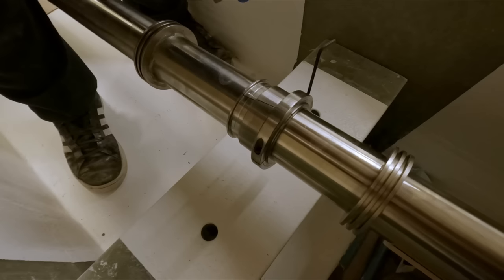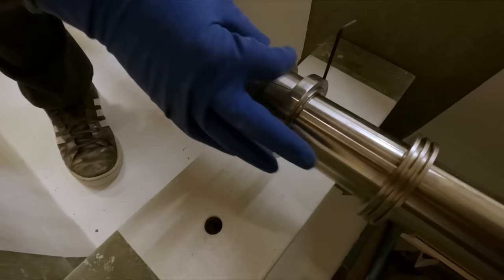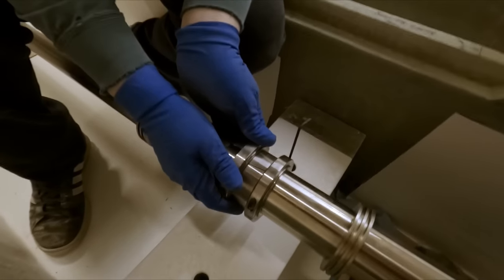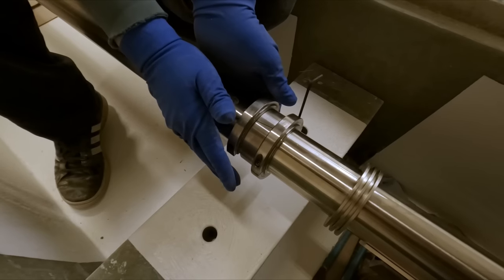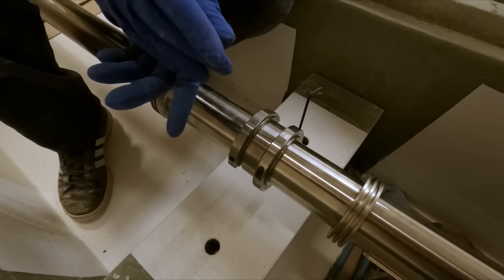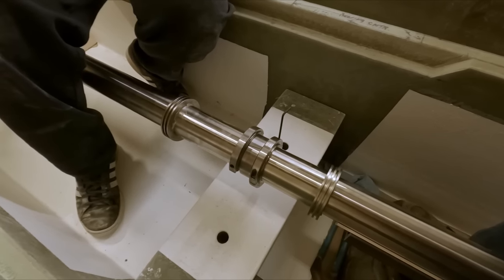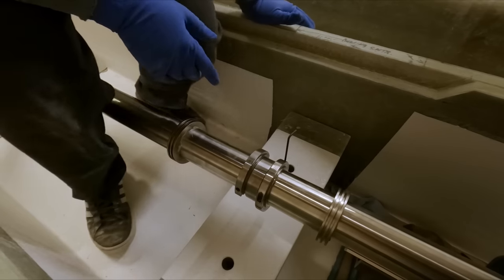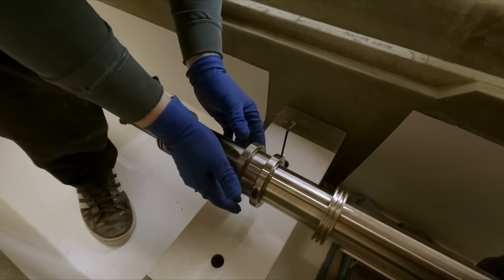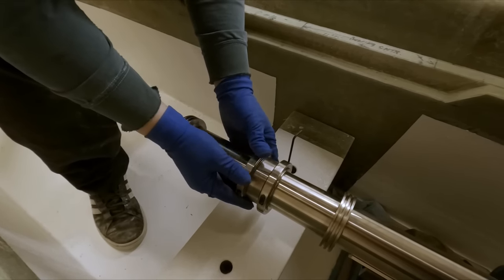Grab this other ring. So this has a shoulder on it where the bearing rides against. These are expanding, which means it gives a little bit of movement this way, axially. There's also another type that's just a fixed one that doesn't allow movement. There shouldn't be much movement in the shaft because the reduction gear is actually built to take up the thrust from the propeller. As it goes forward and reverse, you have thrust on the shaft, and you've got to be able to absorb that and transmit that power into the hull. Otherwise you just destroy your bearings in about 2 seconds. If you looked inside the twin disc reduction gear, there's a huge set of cone roller bearings that are thrust bearings, and they take up all that force.